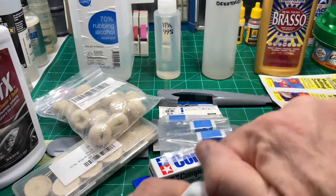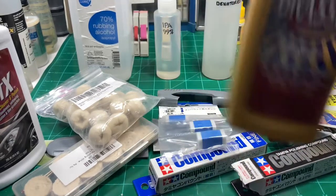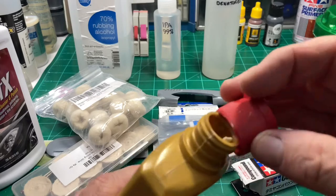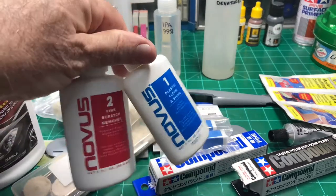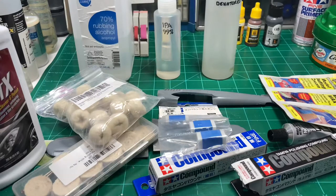You military guys probably remember Brasso - particularly the enlisted guys - it looks very similar. I only use Brasso as a beginning treatment for badly damaged parts, because it actually does have quite a bit of grain and it will leave swirl marks in your plastic. So if you can skip over that, that's good. But the Novus 1 and 2 is very good to use.